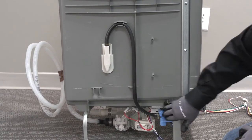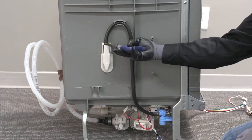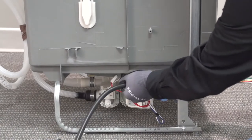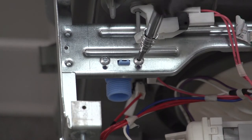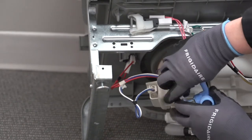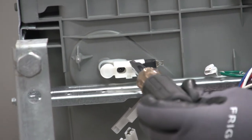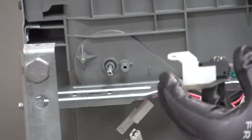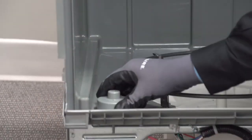This is the fill hose coming directly from the valve. The actual port is part of the tub assembly, so if this is damaged the tub would need to be replaced. I'm going to remove the hose. The water valve has two T20 screws going through the metal frame on the front - disconnect the pink and white wires and set the water valve off to the side. This right here is the overflow switch - there's a screw on the bottom, unscrew it to pull the overflow switch off, and then pop it out from inside the tub.